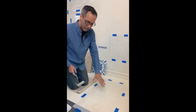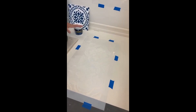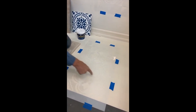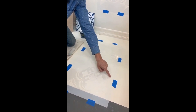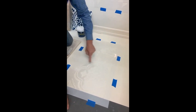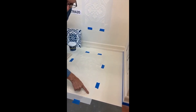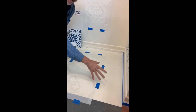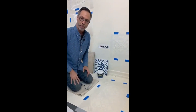I've got my double Santa Ana placed on the floor. It's a 12-inch stencil with a quarter-inch grout line, and I measured off the baseboard 12 and a quarter inches so I have a full repeat into the corner — that's what I want. I don't want it broken there. When you lay out your floor, think about where you want the full tiles and where you want to disguise or hide the half tiles.